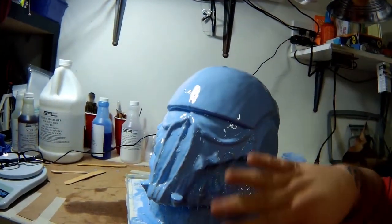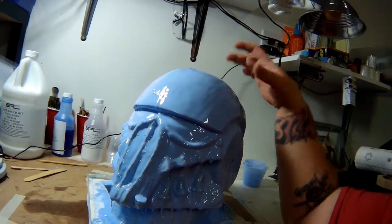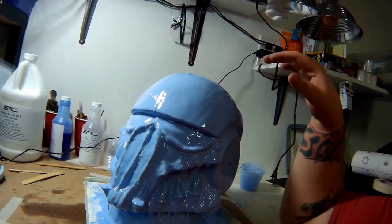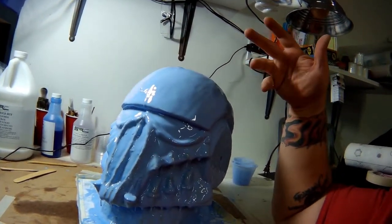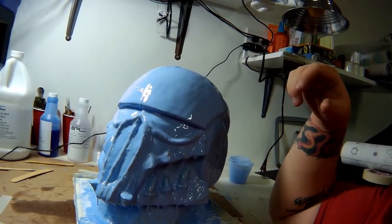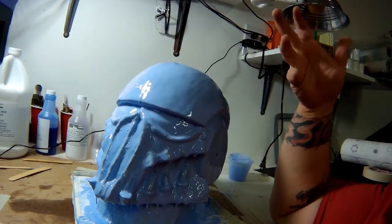And they'll go into place over the mold on the flat spots, just so the mold itself, the rubber part, has a place to key into. So if this was all nice and smooth, like it is, but just one solid smooth piece, and I put a mother mold on it, and I didn't bother to put keys on it anywhere, when I'd put the piece back in after putting the mother mold on, it might not register upright. And then I'd go to pour something, and because the keys aren't holding the rubber in place, the part collapses, or it squeezes out, or it warps, or something.